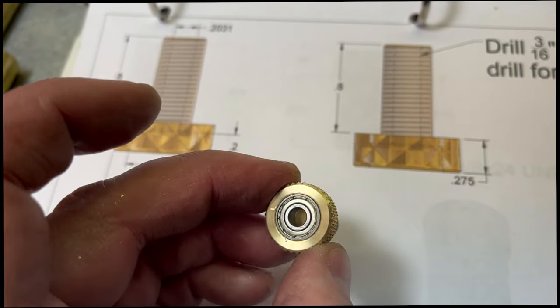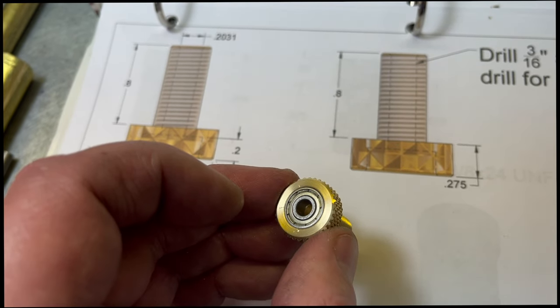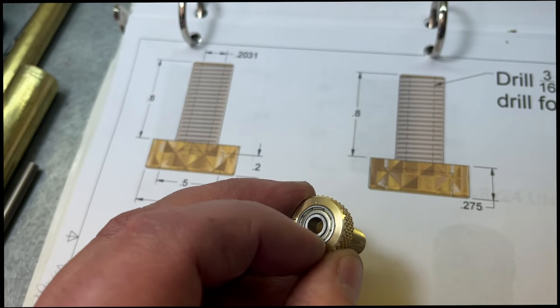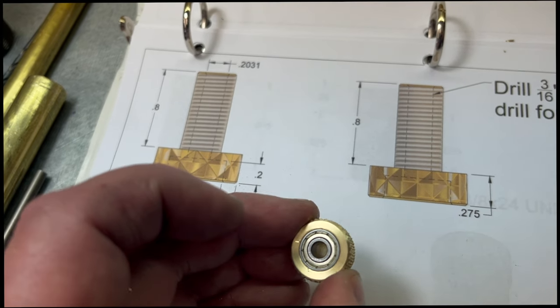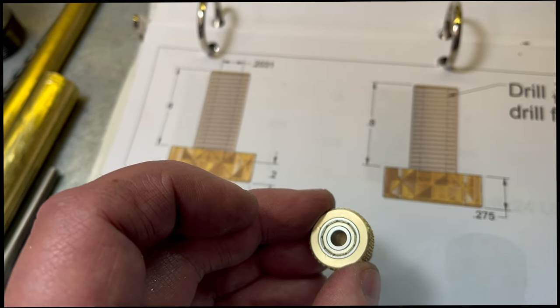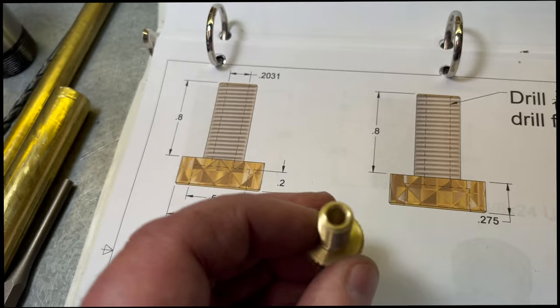So that's looking good. Could also use some bearing glue, that green Loctite, to lock those bearings in there if you end up with just sort of that slip fit. Because you can't put too much pressure on these little bearings or they start to, you can feel them clicking when they roll. So it's not like you can get them too tight. It's definitely a fine spot in there. This one I wanted a little snugger, but popping a couple center punch marks seemed to work pretty well.